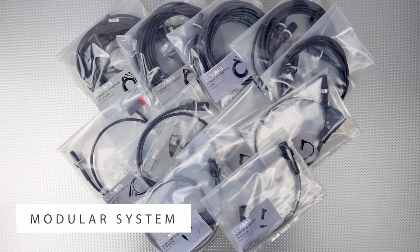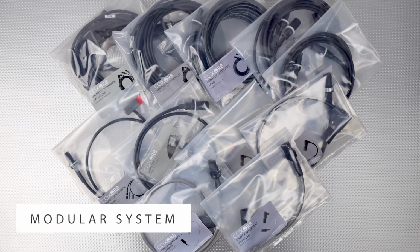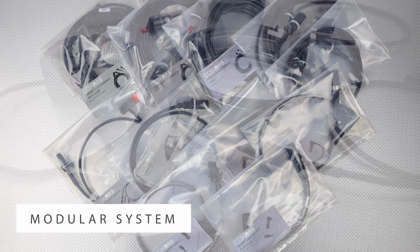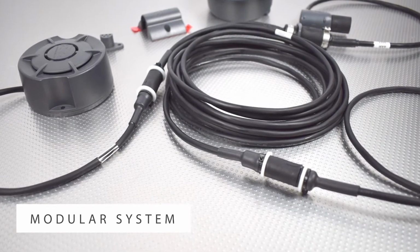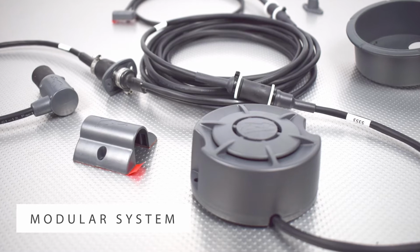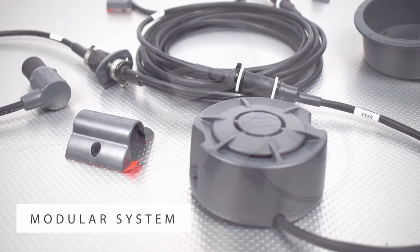All our wiring systems are modular, so they can be customised depending on the boat type and the number of speakers required. This also means that individual sections can be replaced without having to remove the entire system. We use high-grade marine audio cable and incorporate nylon washers on all the connectors to allow easy disconnection without damaging the cables. Each section is individually tested before leaving the factory, and every speaker is pressure tested for leaks.